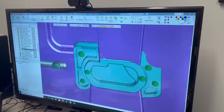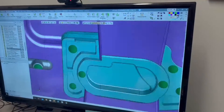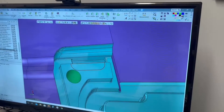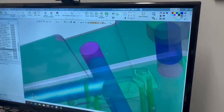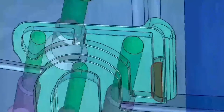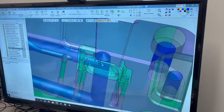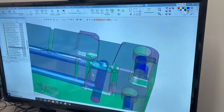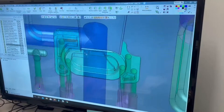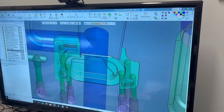Here I want to show the file we're talking about. This is the core of that job. All this area is cuttable except for this one spot right here. Making it transparent so we can see — it's this feature of the part we're making the mold for that has to be burned. Looking back, we had to put very small cutters in here and finish all this detail, when it would have been more efficient to make more electrodes since we already had to set it up in the EDM. Every time we do jobs like this, we find a different way to pick up efficiency we didn't have before.